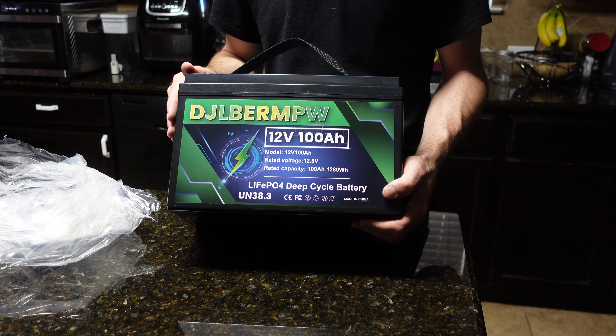Here's the full test setup: the inverter is connected, the current meter is externally powered by a separate LiPo battery, and the current shunt is set up and preset to 100 amp hours so it'll count down and track amp hours used. I turned the inverter on and it's running. The load is a box fan plus a 6 amp 12 volt lithium iron phosphate charger charging a 12 volt power bank - together just under 0.2C. We'll let this run until the battery dies, which should take about four to five hours.